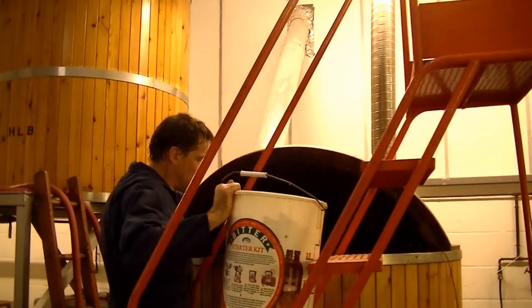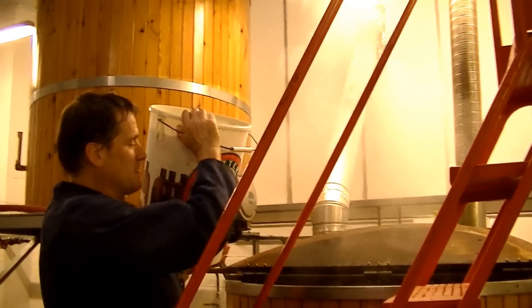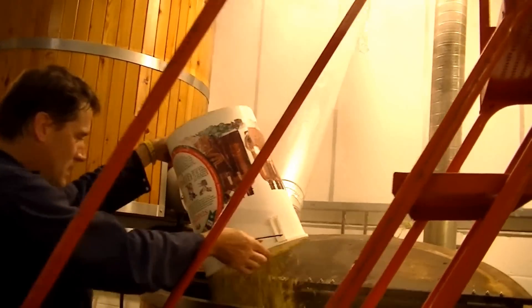And then as it ferments, it is an exothermic reaction so it heats up, and if you did not have those cooling coils it will go up to a very high temperature and make the beer taste kind of strange. So you want to keep it around about 22 degrees. Those cooling coils will kick in again at about 22 and a half degrees, so you've got plus or minus 0.5 degrees — it is quite precise. So we are up to the right temperature now, so we are going to add the hops. It is a simple process of just chucking them in really.